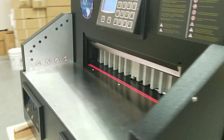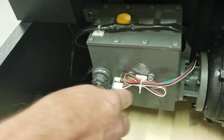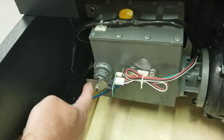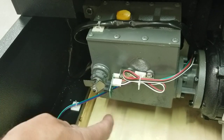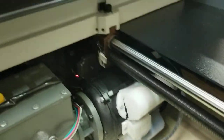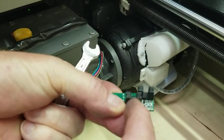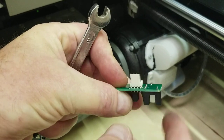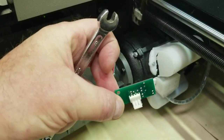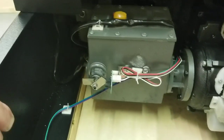So you get the idea. If the sensor is not plugged in you get an F3 or F4 sensor fault — specifically F4. If the bottom tab is hanging and not going through the sensor, you can get an F3. If the top tab is hanging and not going through the sensor, you may get an F4, or if the tab is damaged. Check to make sure each tab looks intact. These sensors have two towers that the tab goes between — make sure nothing's broken. Sensors don't go bad often, but they would be the part to replace if needed.